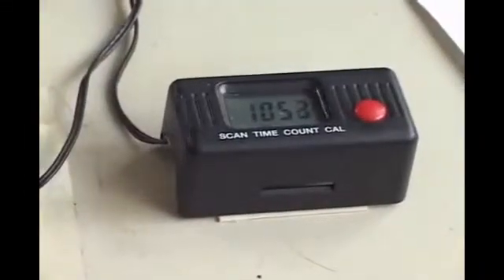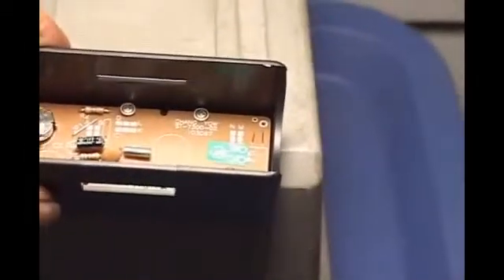Still, it's not a moon rocket. This is a jogging counter meant to strap to the wrist. It had a mercury switch in it. I simply clipped the mercury switch out and added a magnetic proximity switch, then attached a magnet to the arm so that now the counter would register every time the arm swung past the proximity switch.